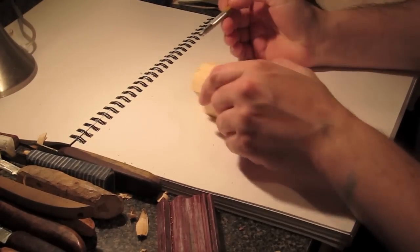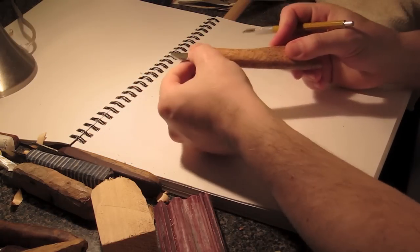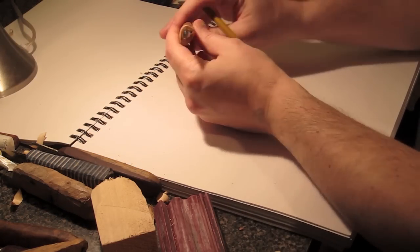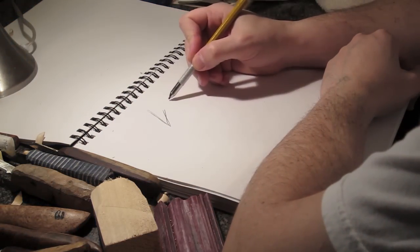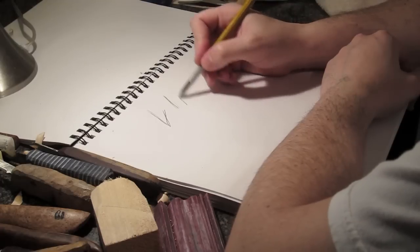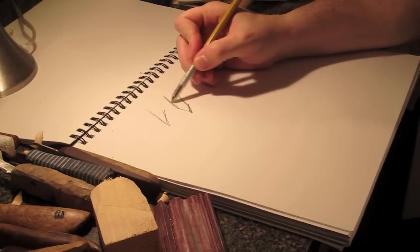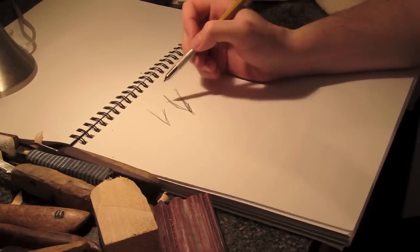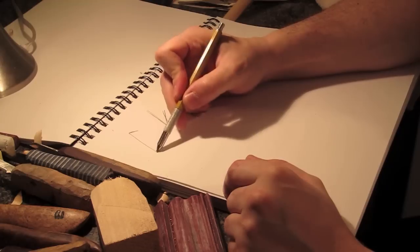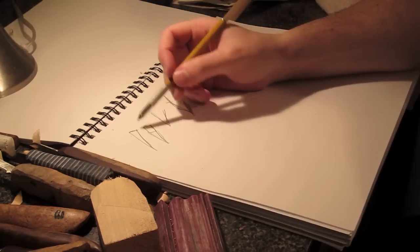Looking at the profile of a blade from the front — that's what we're looking for. A lot of companies still give you a blade that's not quite ready to use. The sides are beveled, but there's a secondary bevel on the front that's generally too steep. You generally need to go about double where that first bevel is, then make a straight line from the point to there.